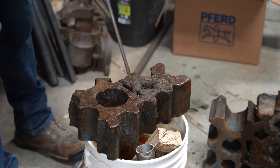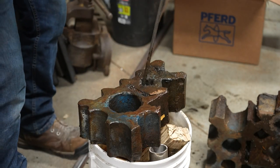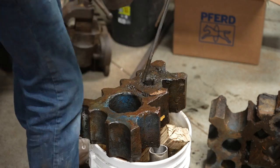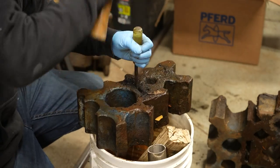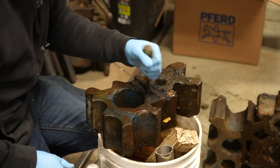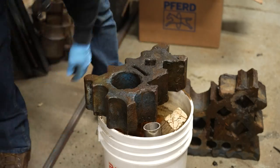If it was one piece, my goal is going to be to try to weld it together using some nickel rod, because this is cast iron and I won't be able to weld it using my normal MIG or TIG welding process. It's packed with dirt, so my first task is to try to get some of the dirt and crud out from inside it, which is actually more difficult than I thought it was going to be. I'm using a chisel and a rod, and eventually I'm going to move up to a drill press to try to massage this dirt out before I put it in some rust removing soak.